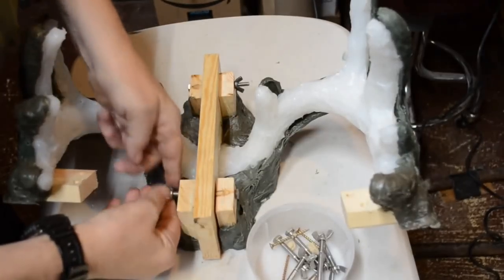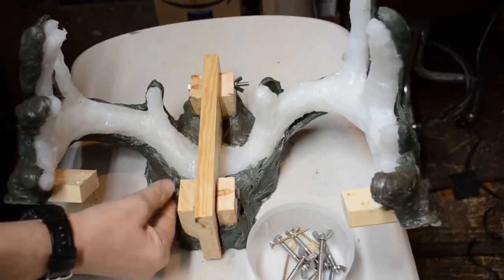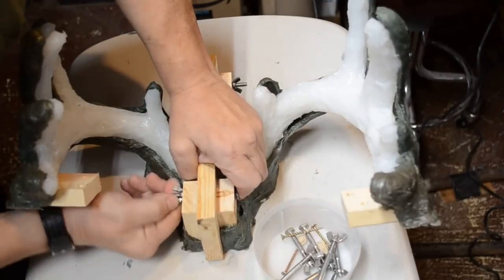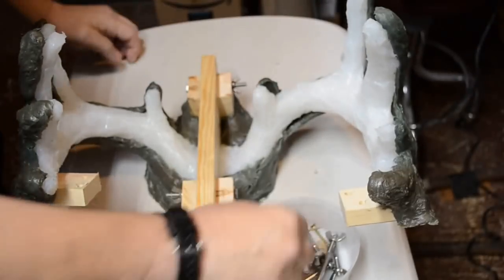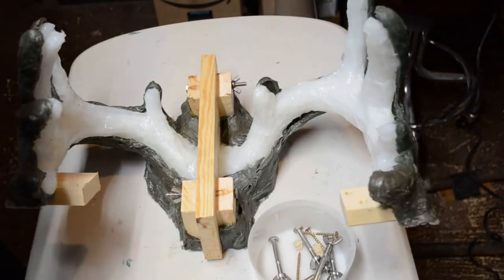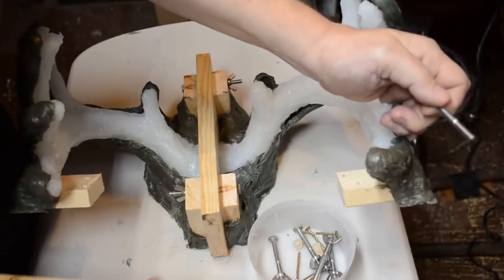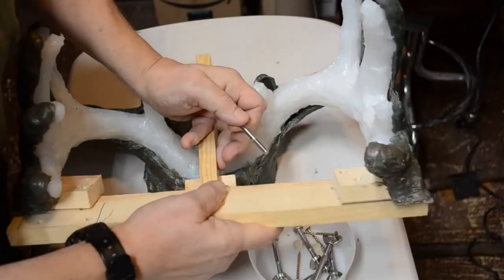There's just a little bit of Bondo that got onto the threads, but after a few uses, that Bondo will disappear. And make sure this is all pulled in tight. You want it to be as tight and snug as it was when it was first created, the cradle. Those are the 3-inch bolts. We take the 2-inch bolts and reassemble, and this will help to lift. Notice how it has a little sag. This will help to lift this back into position where you want it to be.